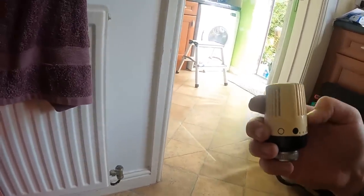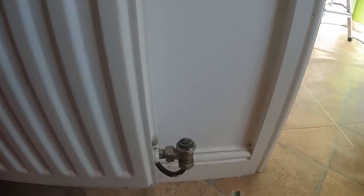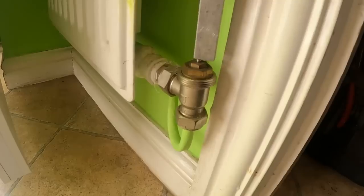When you open it up, that pin should retract back into the valve, making the rad come on. But it's knackered — the springs or whatever liquid gubbins is inside have obviously gone. So all together we need seven replacement TRV heads. I've been round and checked all the pins on the rads move up and down, so the valves themselves are working fine. We just need those heads to replace them and give us complete control over the heating system, make it more efficient, save money — especially now with energy prices going through the roof.